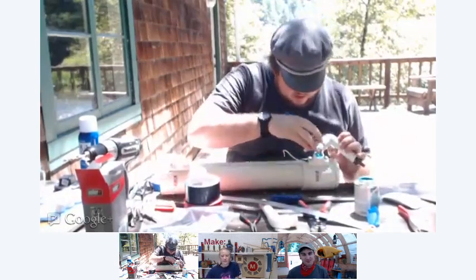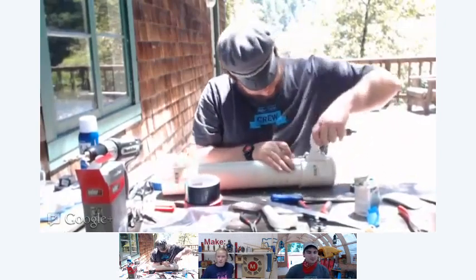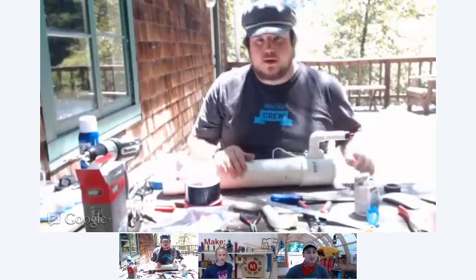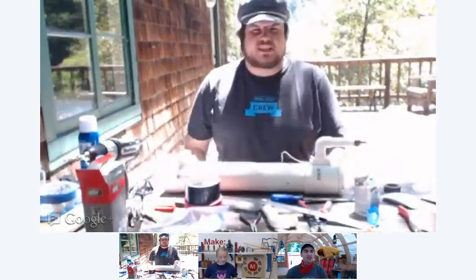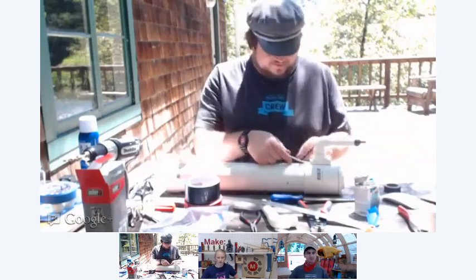Dan, we have a question from one of our campers. All right. Timothy asks, could you just add a valve and pump in 500 PSI and then release the valve? Yes, that would be what an air cannon is. Would you want to use 500 PSI, Dan? Is that about standard? Not with PVC. PVC is safely rated for 200 PSI. If you want to do 500 PSI, which is using compressed nitrogen or maybe a scuba tank, you need to go with something metal. Okay.